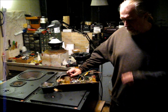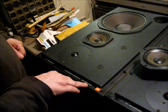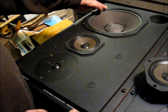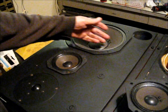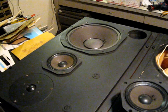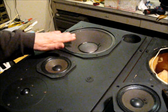Hey, today we've got another do-it-yourselfer project — the JBL L110. The owner had done the suspension replacement themselves. One of those was coming loose in several spots. I've got it over on the bench. I've realigned it and re-glued it. Now I'm going to overcoat that edge.